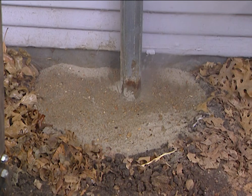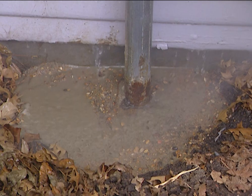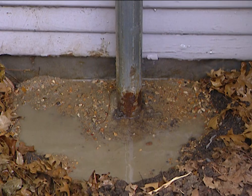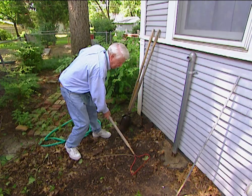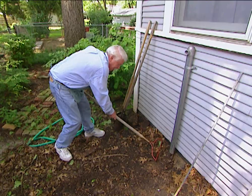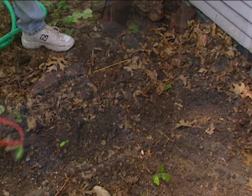As they say, all you have to do is add water. That's going to soak down in here, but we're going to help it a little bit. It's going to take about 20 to 30 minutes for this to set up under here, but we can go ahead and cover it up now — it will set up, that's not a problem. We also have to level it here so that we've got room for our fence and it's not down in the ground like the other one was.